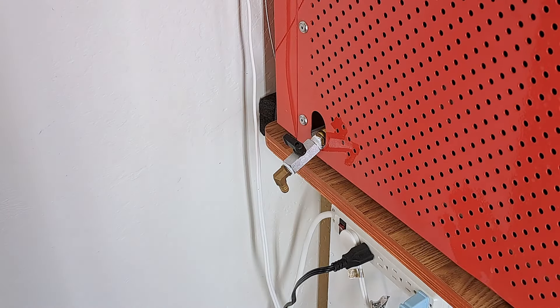That's back together, and then I can get the drain tube back on there. The drain valve on mine is still fine — it's been over six and a half years, everything inside looks perfect, all shiny and clean for the ball. It hasn't leaked at all. If it does leak, I do have a spare, and it's a stainless steel one instead of the chromed mild steel which pitted like crazy on my sister's. We replaced hers with one — I don't know how it's going to do long term because it's a brass one. I have a backup that is stainless steel with a stainless steel ball, so if either of ours fails, I'll have a spare. Next we're going to work on a little project with her seal.